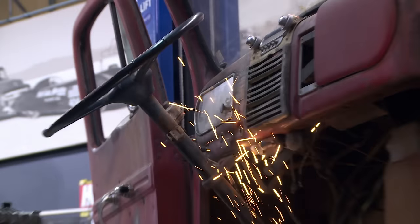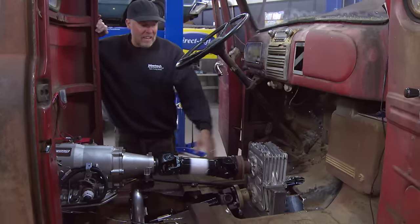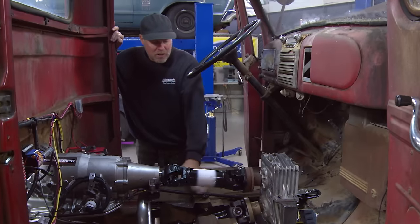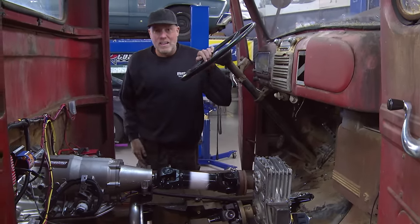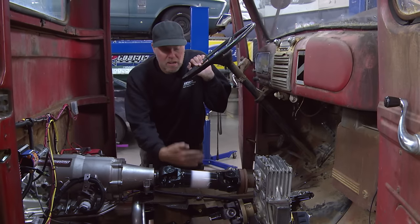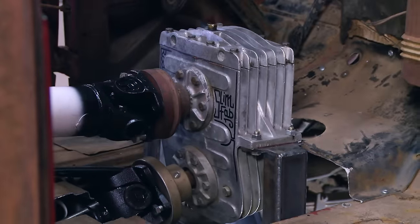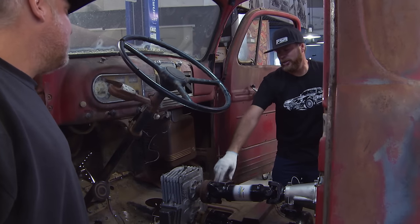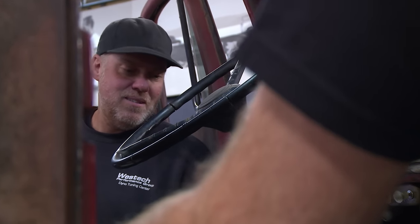The main thing is going to be keeping this from killing us, which is a real thing. If this breaks off of its mount or if either one of the drive shafts breaks, they're just gonna swing around, and with our legs right here, it could be really ugly. So we're gonna take 3/16 plate and completely enclose all of this. Here's where I admit that I only measured to here, so really the parts that I bought to build this aren't long enough to actually cover that.